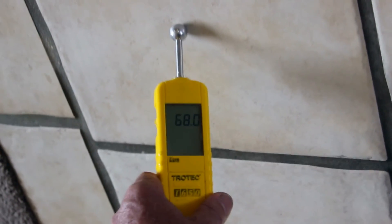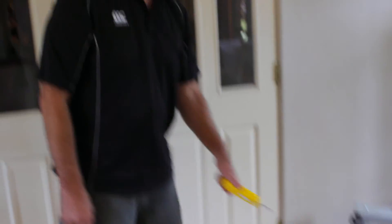This particular property is on a concrete base, so you must remember when using your moisture meter on concrete — it's not really designed for concrete. You can use it, but you have to be aware that concrete will greatly increase the readings. This floor is dry but it's getting readings in the high 60s, which would be normal for concrete. However, when using thermal imaging you can often still see the damp or wet area in the IR images and the readings will still increase.